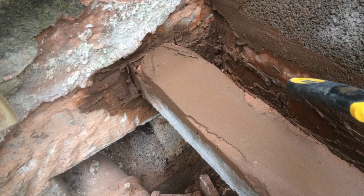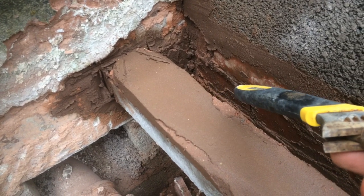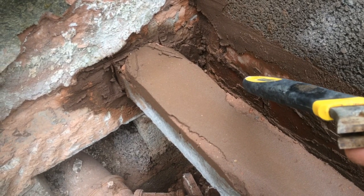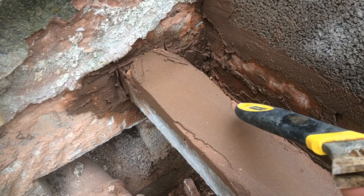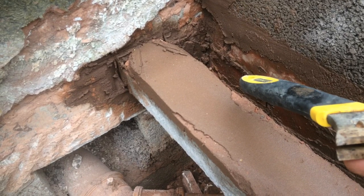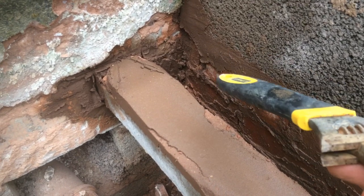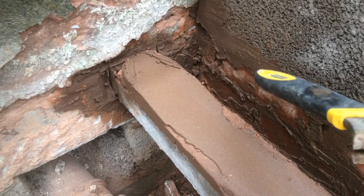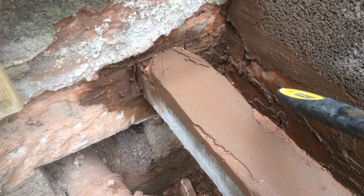So in that case I just used a breaker drill — you know, like a Kango hammer, or just a small pneumatic drill which is quite common, an SDS drill, something like that. You chisel a hole in the wall which is big enough — a bit bigger than your lintel — because you need room for mortar, and also you need room to align it up and down and side to side.